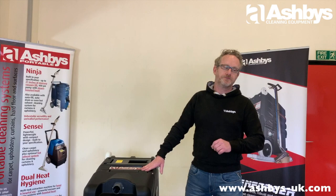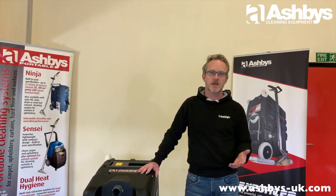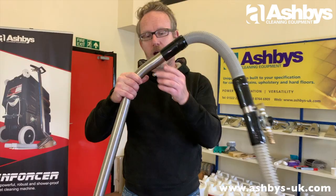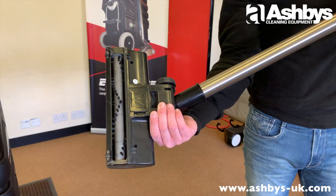The theory of carpet cleaning: when you clean a carpet, you first want to thoroughly dry vacuum. You can do that with a standard dry vacuum cleaner — an industrial one preferably, with some kind of turbo head. We offer a dry vacuum attachment that connects to your machine; the clever bit is the air turbo head complete with hair wrapped around it.